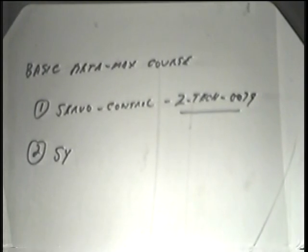If you pick up a model and you've got a servo problem, you would go to your basic Betamax servo control, and look in the index under model SL3000, and it says here drum phase, whatever. You turn to page 30, it'll tell you what changes were made from the original model. But then you'll say, yeah, but I don't even remember what the original one was like. So you can go right to the front of the book, and it'll start right from day one with the basic circuit.